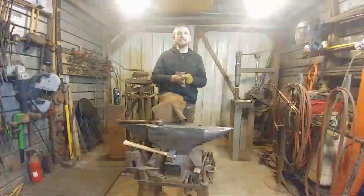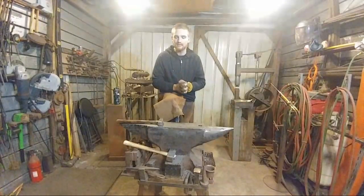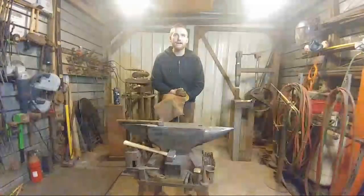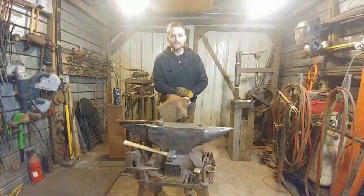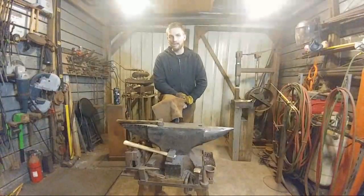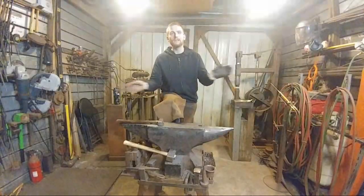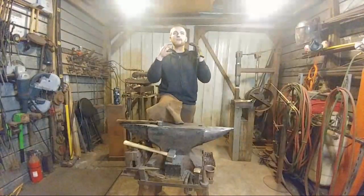The anvil bases themselves, I think, are more or less to keep the hammer in place and to absorb all the kinetic energy that's coming down. So when you're working on a 465-pound anvil, I'm not going to be hammering with a 46.5-pound hammer. That's not going to happen, and so it goes completely out the window. The only time that the ratio matters is when you're working with a very small anvil.